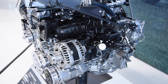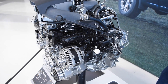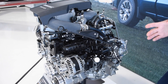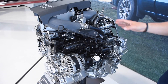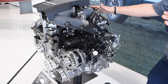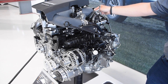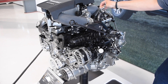We can always keep the engine temperature constant — running always hot means always lower friction levels. Our exhaust system needs to stay hot to be most efficient for emissions. When running low load at 70 miles an hour, the engine's really not doing enough work to keep it hot. By lowering the coolant flow, we can get the engine running a bit hotter, closer to its efficiency point, and better for the emission system. This is what allows us to get great fuel economy. Other manufacturers might have to inject more fuel to keep the aftertreatment hot — we're trying to give that fuel economy back to the customer.